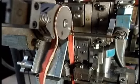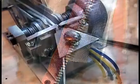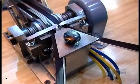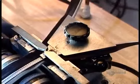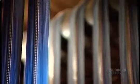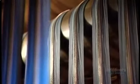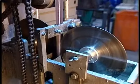Workers now feed two tapes with metal teeth into what's called the joining machine. The teeth interlock, meshing the two halves of what's now a continuous zipper. From there it's into a cleaning machine, which first washes the zipper, removing any shards of metal left behind by the tooth-cutting process. After drying the zipper, the machine applies a coat of hot wax, which lubricates the teeth so the slider will glide over them smoothly.